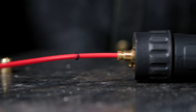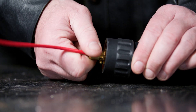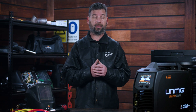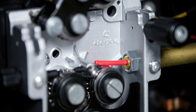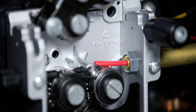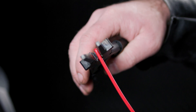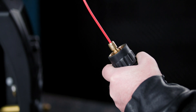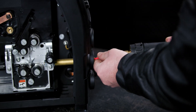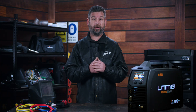Don't forget to move the collet and the o-ring, so they are clamped into place by the retaining nut when it's screwed in. Reattach the torch to the machine to make sure that you can line up the liner correctly. Then feed the excess liner through the guide tube and into the machine, where it will butt up against the drive rollers and hang out past them. Cut the liner to a length where it isn't touching the drive roller, but it's slightly protruding out of the end of the guide tube still. Having the liner go all the way to the drive roller, if possible, helps to stop potential bird nesting that might have occurred if the wire was free to bounce around in the open guide tube.